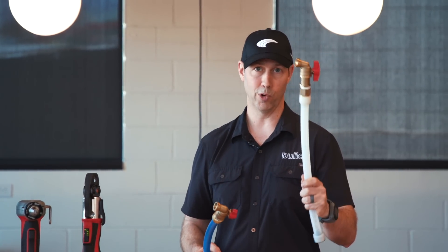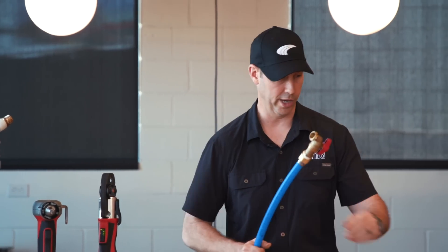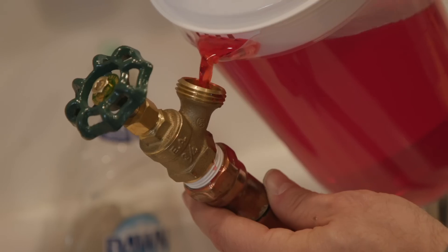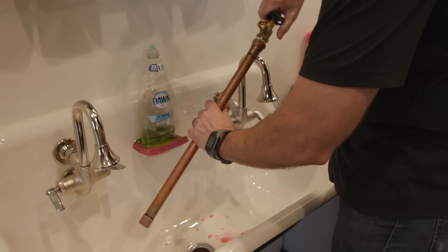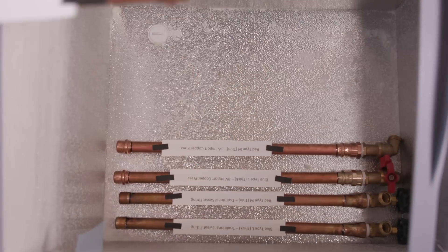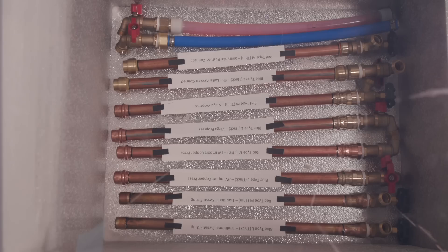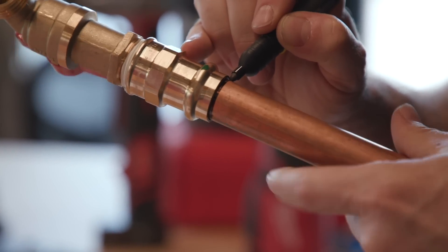It's kind of a control. We've done these before but I'm curious to see how these do versus copper. I've got Uponor PEX — you've seen us do that before — that's going to go on with this expansion tool right here. And then I've got Viega's flavor of PEX, which is going to go on with the crimp tool and a crimp ring. I've built a lot of houses with these two systems. We're going to put water in each one of these, close the valve off, make sure there's no air in there, tap them a couple of times to make sure they're totally filled. Then we're going to lay them in an ice cream freezer that I actually bought specifically for this test. Keep your eye on the intersection between the pipe and the fitting, because I'm going to have a nice line of Sharpie there — so if that fitting is moving at all, you're going to see it based on that Sharpie mark.